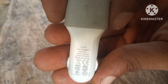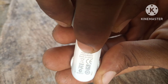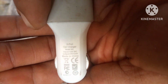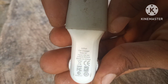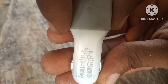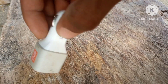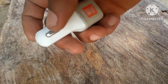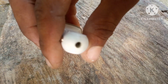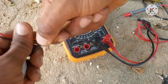This here is a 12 volt to 5 volt DC-to-DC converter — most of you might recognize this. It's used in cars to convert 12 volt DC to 5 volts so you can charge any 5 volt device. The output of this converter is 5 volts at 2.4 amps. This point is where we hook up the negative port of the solar panel, and the little hole there is where we connect the positive terminal. Now let's hook that up and see if it actually works.